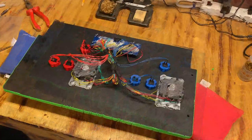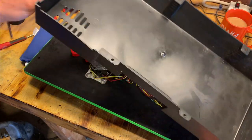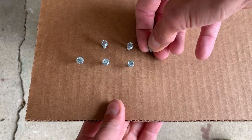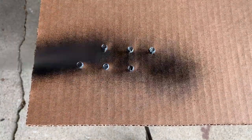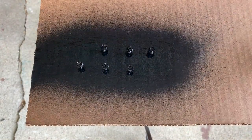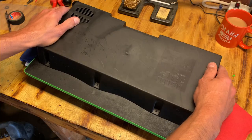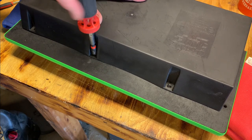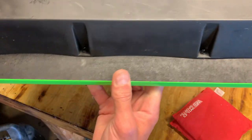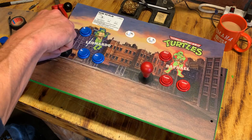Since these controls are for a four-player cabinet, you're going to have a little bit of excess wiring, but with a little bit of effort you can go from messy to clean — not bad. To really clean up the underside, we're going with a stock Arcade1Up bottom control panel cover, picked up from youplay.com — a link will be in the description. Some of the fasteners have shiny zinc-plated heads; I wanted those to be black, so I push them into some cardboard and hit them with paint. Pre-drill the holes, the screws go in nice, and the results speak for themselves.